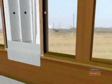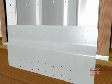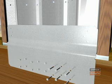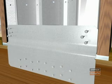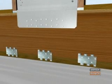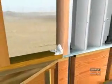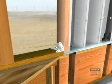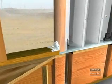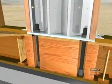The SSW shear transfer plate is then installed on the outside face using 10D nails in the rim joist and number 14 self-drilling screws in the upper strong wall. Install the specified number of LTP4s from the rim to the sill plate. Finally, install A34 connectors on each side from the SSW stud to the wall sill plate. This is what a properly completed installation for a first floor wood floor system should resemble.